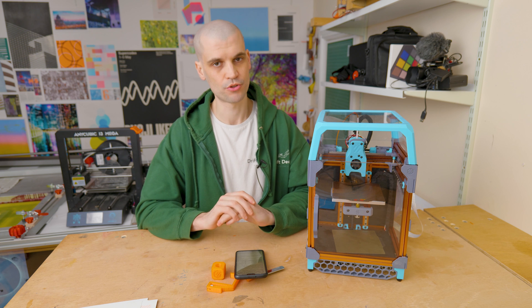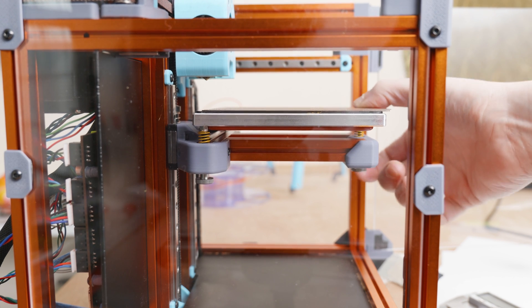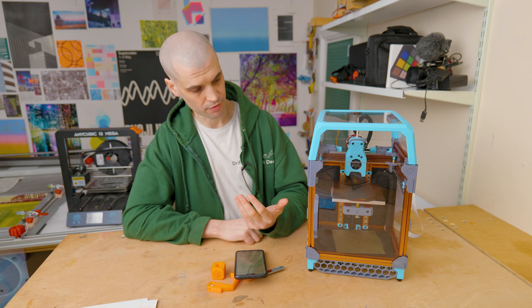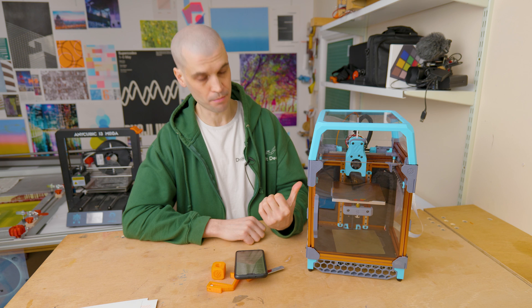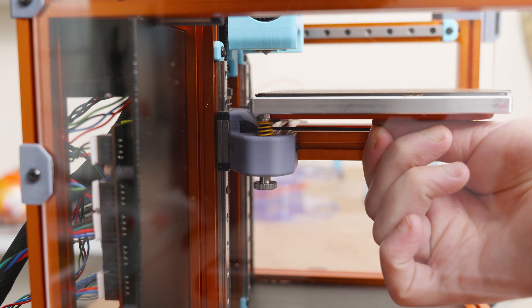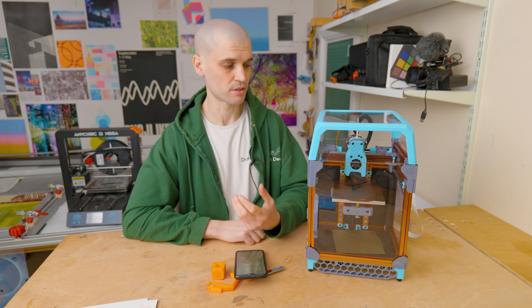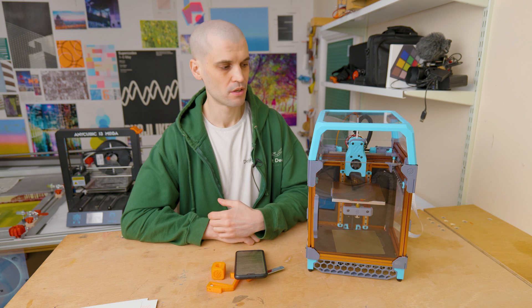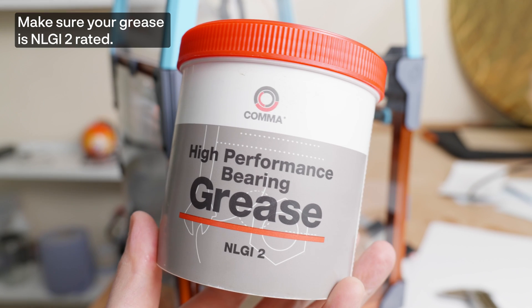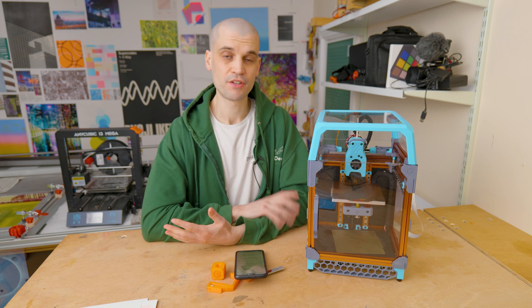After a few initial prints, I did see some creep set in — most noticeably on the bed, which was visibly drooping down from this angle. It wasn't the ABS having melted — it was just some screws attaching the bed to the linear rails coming a little loose. In general, once you've printed a few times, go around the whole printer and check for any creep and tighten everything again. Basic maintenance like lubricating the rails — I just put a tiny bit of bearing grease — should be good enough for the next six months to a year.